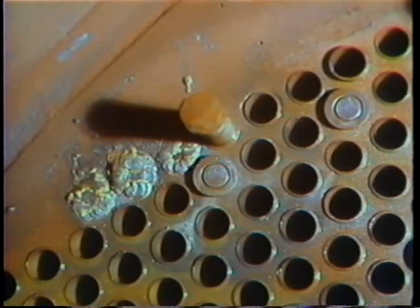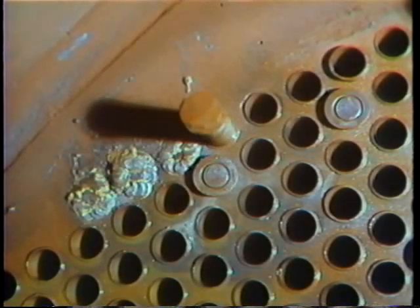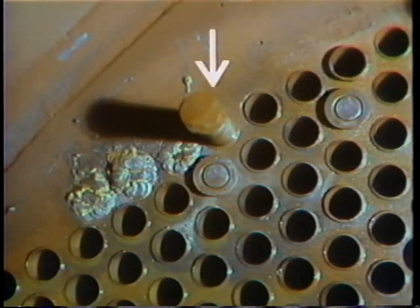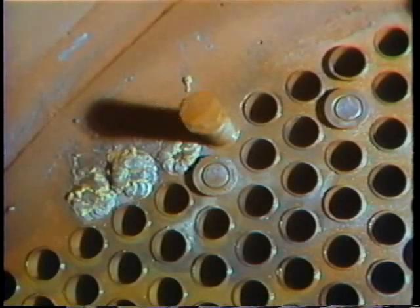Now let's take a look at plugging leaks in a high-pressure feedwater heater. Here we'll see two other methods of plugging tubes and leaks between tube ends and tube sheets. This big heater has been opened because it was known that it had some leakage. When they opened it up, they found that some tubes were leaking, and also that some of the tube ends had vibrated loose from the tube sheet and were allowing leakage. The older plugs here are expandable metal plugs — the hard metal pin in the middle is driven in with a hammer and forces the softer metal of the plug to expand in the tube end. The others are tapered metal plugs just installed recently. Notice that some of these have been welded in place to seal a leak between the tube end and the tube sheet. Where several adjacent tubes may have come loose at once, the whole bunch of them is welded over to seal any further leakage.